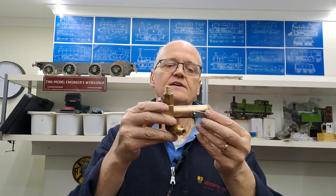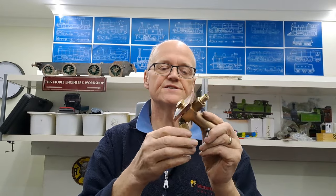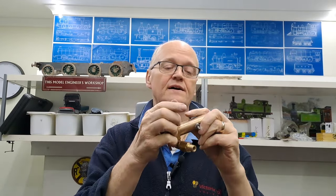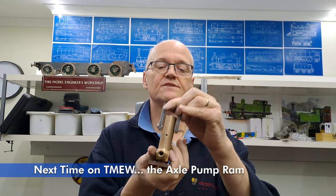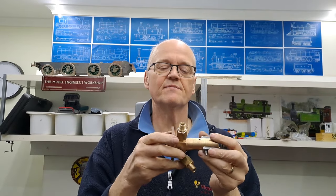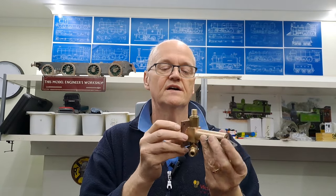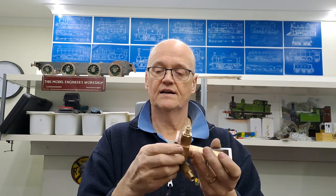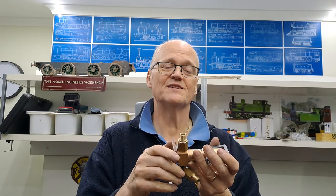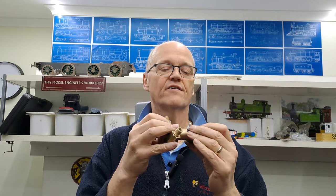Righto, guys. So that'll bring this video to a close. Axle pump, yoke, the pin, all the bits, the plug, the flange, the suction and discharge, the little valves, the fittings they run up and down in. And yep, it all works nice and easy. I did just put a little drop of oil in it. So this is the end of a whole series of videos, isn't it? Got a little bit of cleanup to do. There's one or two rough edges I just want to take a file to, but it's done. In big chunks, it's done. This could literally be painted up now, lined up with the copper washers once I get them right, and bolted into the frames ready to go. Still got to get the frames off to the grit blasters, and they'll come back fully painted in a lovely shade of dark grey.